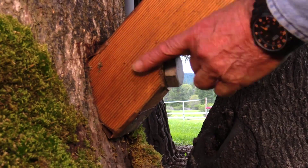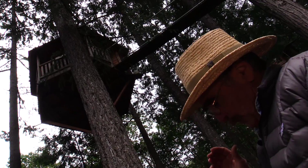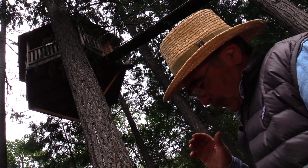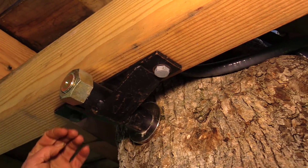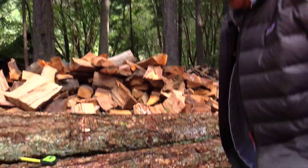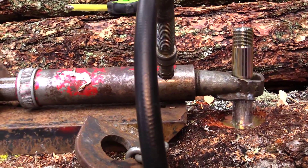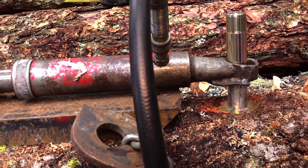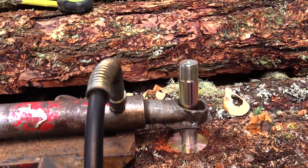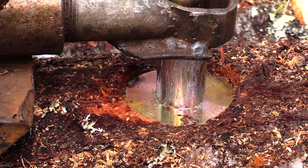In a knee brace it's more in compression, not in shear — but we're using the GLs in shear, and a lot of the brackets we use are for shear. Now with the GL, we've got 1,000 PSI. Now get it up to 1,500 — it's stretching the wood. We're at 1,500 now, that's where the lag bolt just started moving and wouldn't hold anymore.